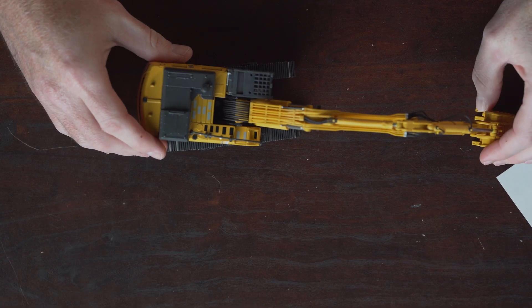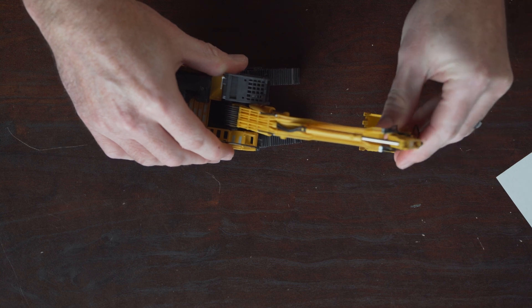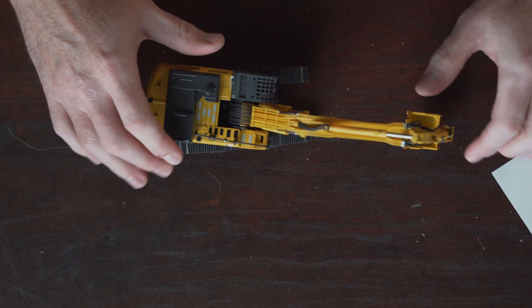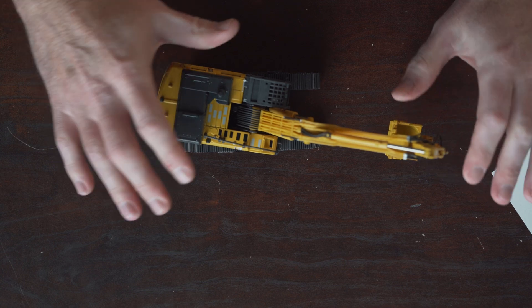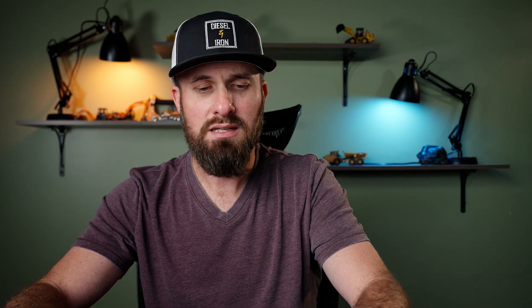So how do we deal with that? Think about a teeter-totter when you were a kid — if the weight is extended way out, you're much more prone to tipping, but if you can get that weight a little closer, boom up and stick in, suddenly you're not tippy anymore and you have a lot more control. One of the first key concepts you're going to learn in an excavator is that when you're dealing with heavy loads at full reach, the goal should be to get those loads in tight to the machine as quickly as possible so you have control and maintain stability. As a rookie operator, a key concept is just bring that load a little closer to you.